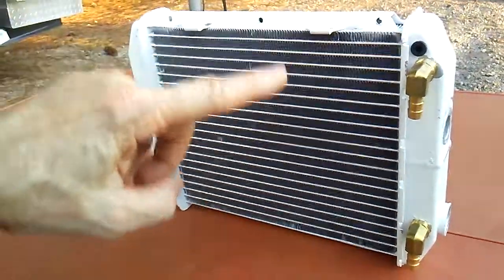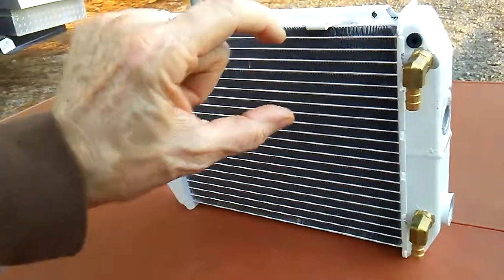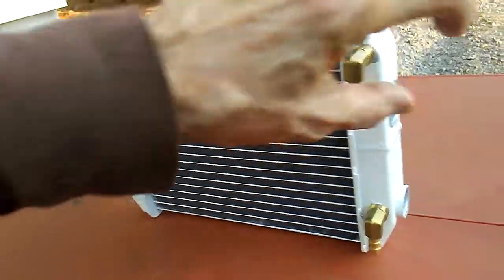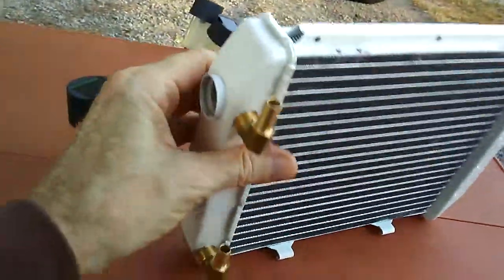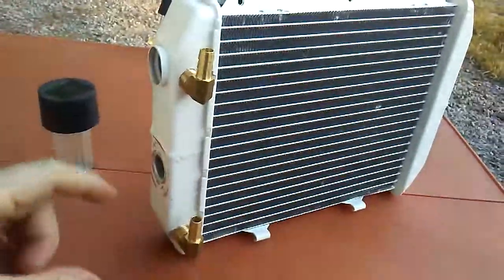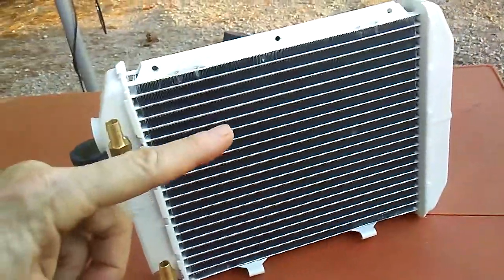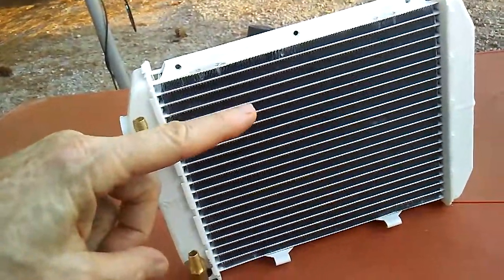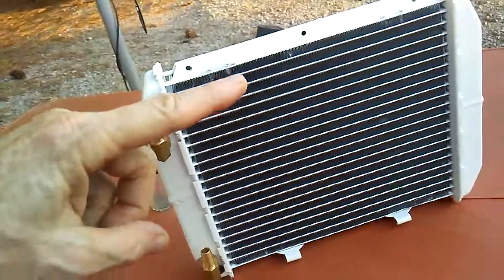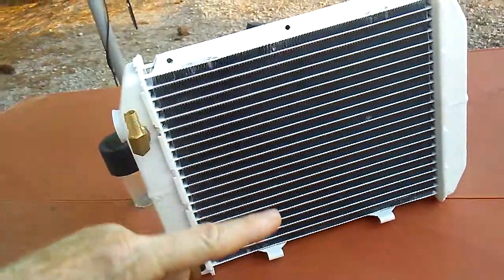So the fan will only pull the air across the cold portion here, and this portion won't be as cold because it won't have water in it. If it were turned this way, it would work a lot better, but not perfect. But the water flow would be up here to the return. So if the air box stopped right here and all that was cold, full of cold water, and that was just full of air or empty with a vacuum, then at least it would be more efficient.